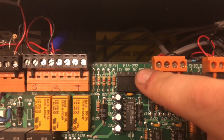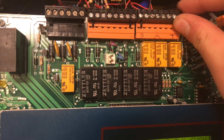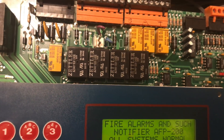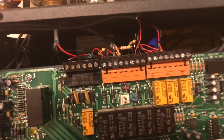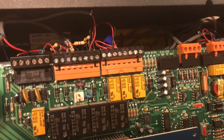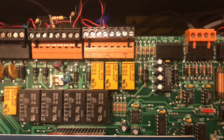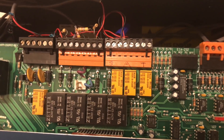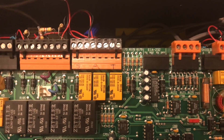All these blocks will pop off and you can see the labelings in the back. Here's one that doesn't have a terminal block on it, so it actually shows you everything — you take this part off and you can see the labeling, then screw in as you need. Here are your three relays; they are not programmable — you just have supervisory, alarm, and trouble. Regardless of what is causing the condition, it will trigger for that specific condition.